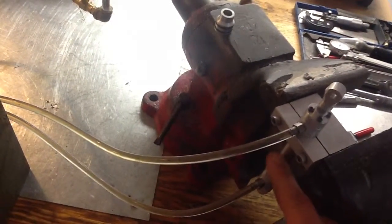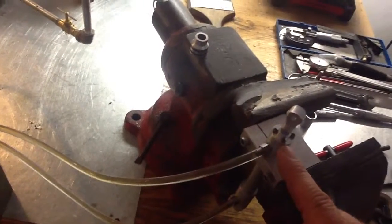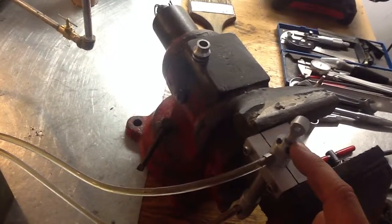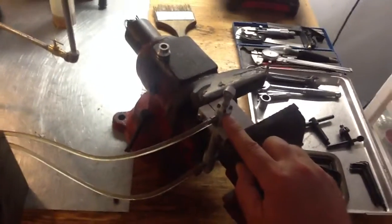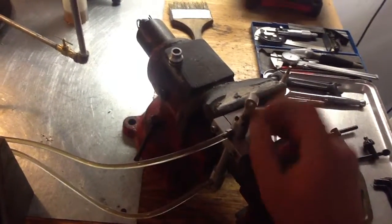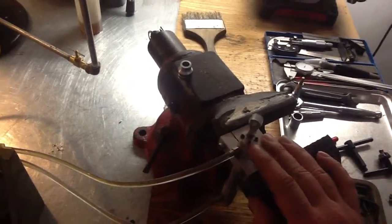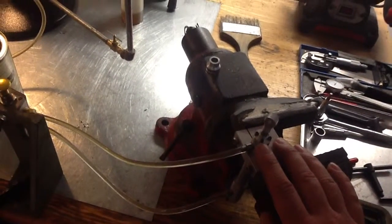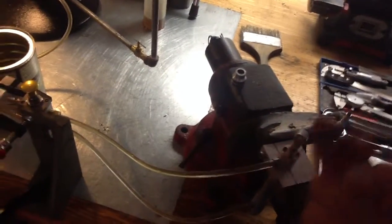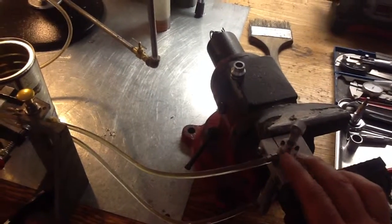So I went over the design of the piston. The head has got some grooves milled inside in the inner diameter that, just like the piston, take O-rings that are fitted on the inside of that. I tried to do two of them, but I actually messed it up, so I think there's actually only one in there now. I'd like to do another try and get two of them in there. So that's what seals the rod against the head — there are O-rings in there. There's no Teflon or plastic or anything fancy. I think real ones use a gasket that's kind of got a V-shape going down so that the pressure compresses it against the rod, but I have no idea where I'd purchase something like that. So I'm just kind of slumming it with my O-rings.